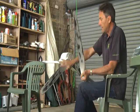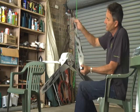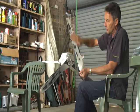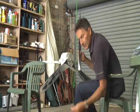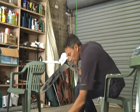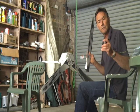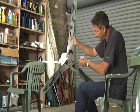I've mounted two blades already. As you can see, there's a flat surface and a curved surface — the flat surface always faces the front. For the stainless steel bolts, I'd highly recommend that you put a bit of grease on them; this just prevents any moisture build-up in the screw joints.